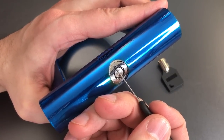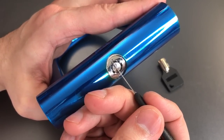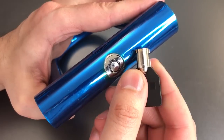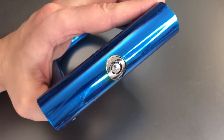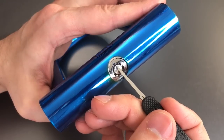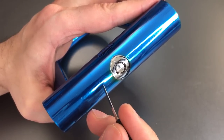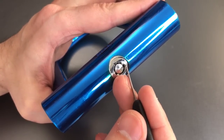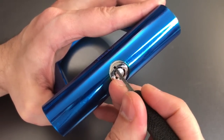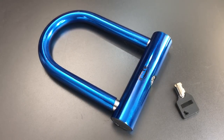Instead, this lock is tensioned from a small ring that's right underneath the outer faceplate, and that ring has a notch in the 12 o'clock position. That ring in turn is turned by a small lug on the end of the key. We can easily access that notch in the ring when the lock is in its locked 12 o'clock position. However, if you do have to pick this more than one position — and that is the case with this bicycle lock, you do have to turn it at least two positions to retract the locking bolts — it becomes very, very difficult to access that ring. So Bell certainly did its homework and tried its best to make this a pick-resistant tubular core.